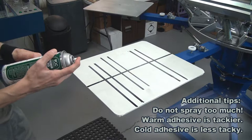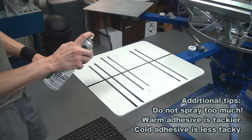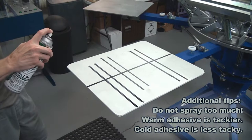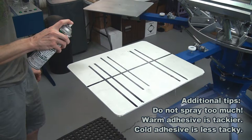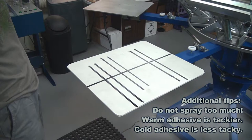Web tack is a little different in how you apply it — you really have to kind of be like Spider-Man because it's kind of like a spider web. You have to jerk the can across in order to spray and fan out the web. So as I hit the nozzle, I'm moving like this. Hopefully you can see that on the camera. And that's how you properly apply web adhesive and mist adhesive.